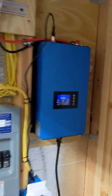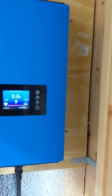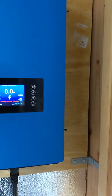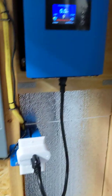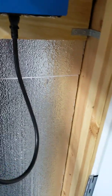So the grid-tied inverter — right now obviously it's not putting out anything. I picked it up off Amazon for like three something. At first I bought a really cheap one, plugged it in, got it all connected, did all the work, and it wouldn't do anything at all — it just never worked. So I returned it and picked up this one for basically the same price, but this thing worked right out of the box. No problems, no issues, no challenges. It worked great. It comes down here and feeds into this. One thing I'd recommend: if you do a grid-tied solar system where you're putting any significant wattage back into your network, don't use tiny 18-gauge cable. Order a really nice one — this is a Tripp Lite branded cable and it's like 12-gauge or noticeably thicker and stiffer.